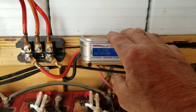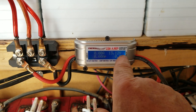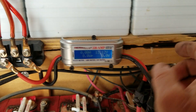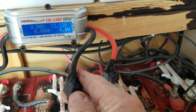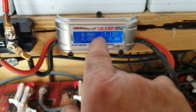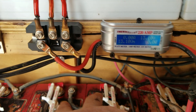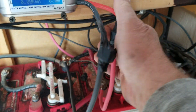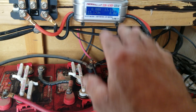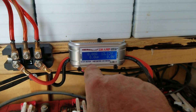So that's what this is all about. This is just the meter — it's coming out of the rectifier at 12 volts, going through the meter, and it reads whatever output I'm getting from my turbine, my PMA. Then it comes out here. All you have to do on the two outputs is connect them to the batteries: black to the negative, red to the positive. This is keeping track of my battery voltage, and when the turbine starts producing it'll track what I'm producing.